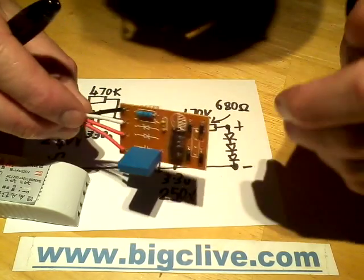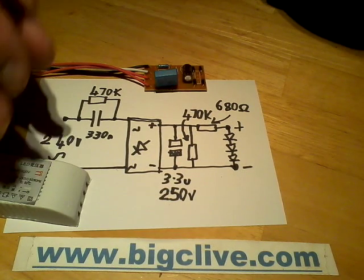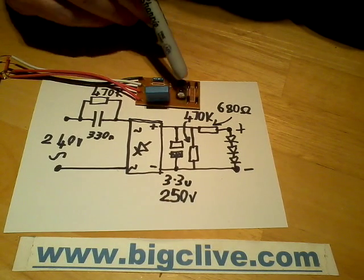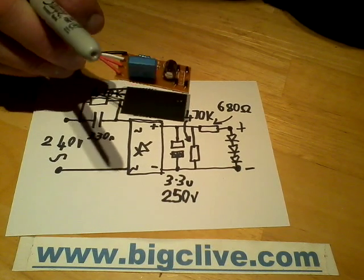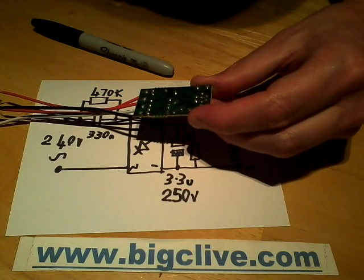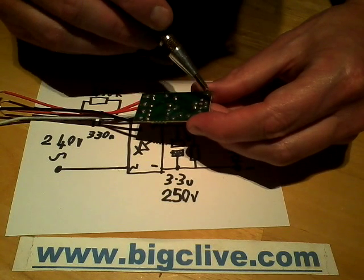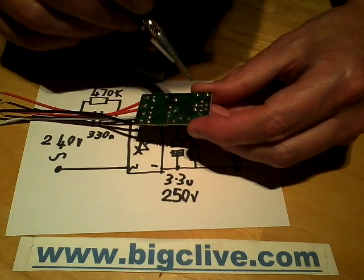because these things are 99 pence including shipping from China to the UK, which is really negligible. So it's useful enough, but I have to say, if I used it, I would change that capacitor. I might even change this one and lower the value, because I like underrunning stuff. Tracking distances aren't that great. I know it's all operating at high voltage, but when you look at the distances between the mains side and the rectified output, they're sub-millimetre, it's not that great.